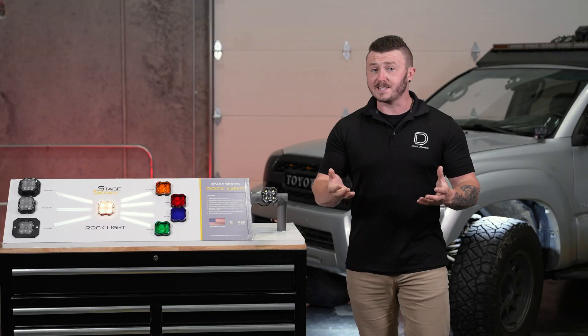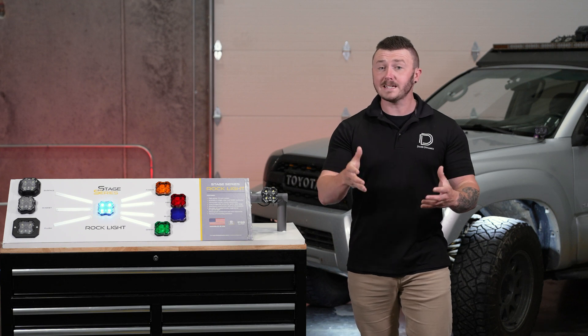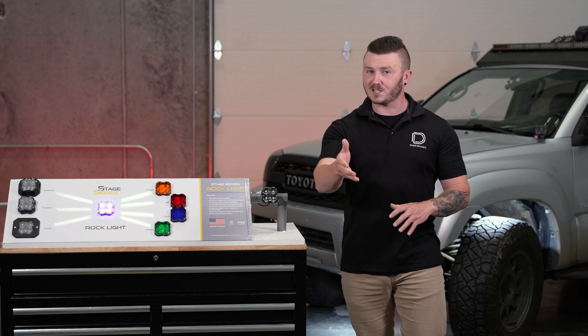The other main failure we saw in our competition was the wiring harnesses. Therefore, we designed a custom over-molded multi-conductor cable that utilizes M8 barrel connectors, providing a robust watertight seal. This added process guarantees durability against any elements you may encounter.